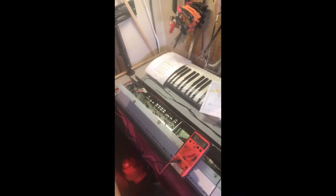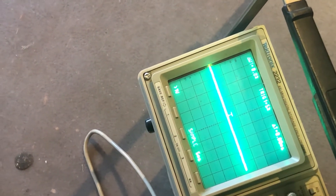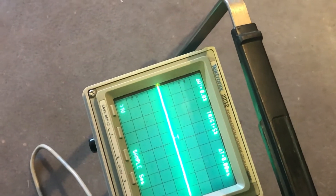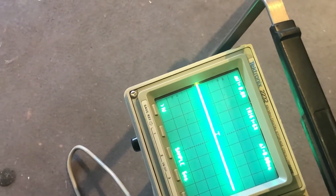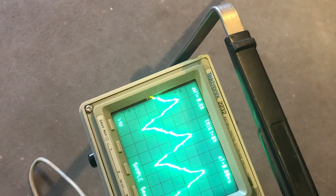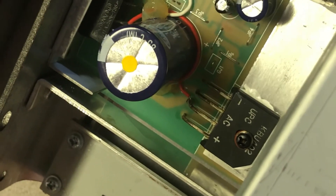To validate further, I'm going to hook up an oscilloscope to the same pins to see if I'm getting any AC voltage ripple. Checking pin one of voltage regulator number one — that signal does not look clean; it looks pretty bad. Checking pin three and voltage regulator number two, I'm getting something similar with visible voltage ripple on both sides. My initial inclination is that I've got a potential issue with either the bridge rectifier or the capacitor.